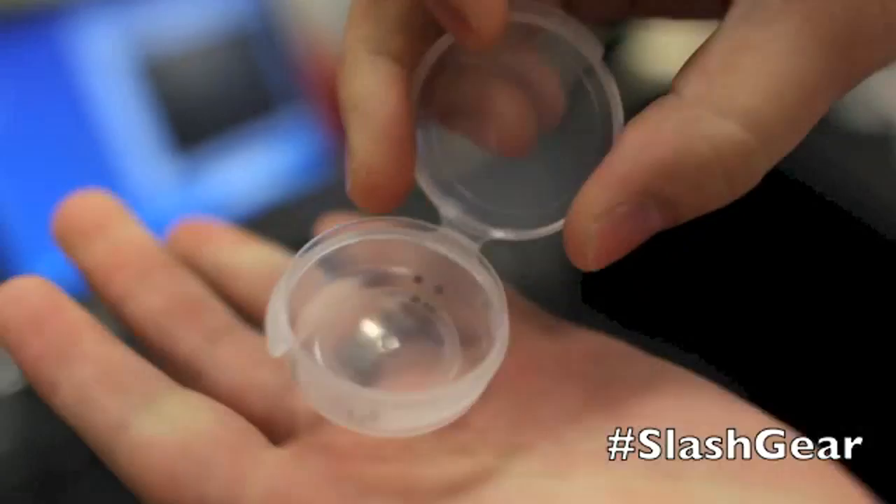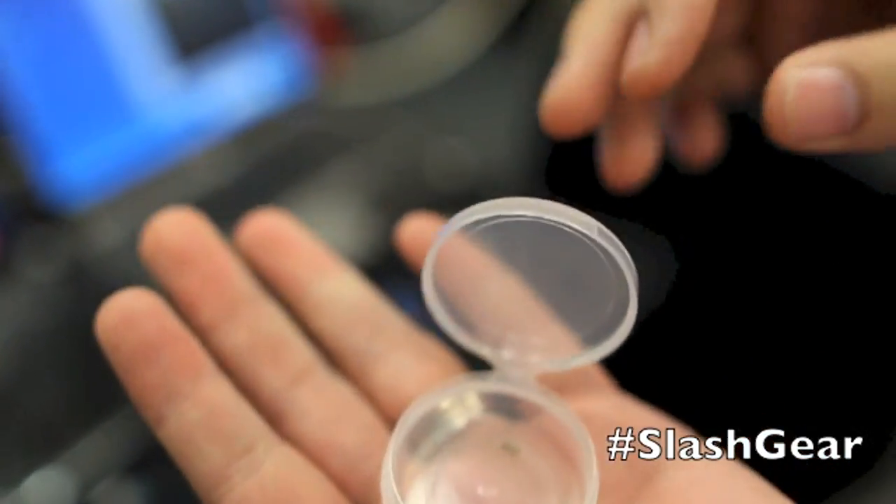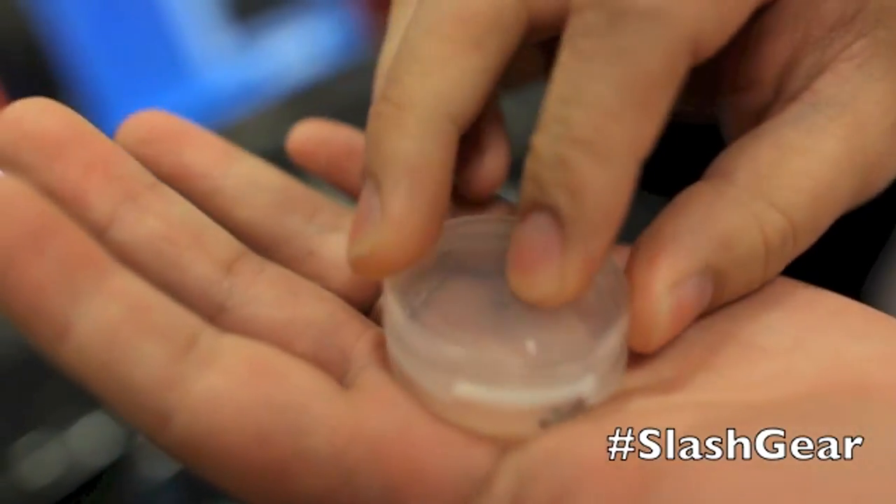We have it right here. As you can see, this is an extremely small device — it's a 1.6 by 1.6 millimeter fully integrated thermopile sensor. Not only does it have a thermopile, it has integrated signal conditioning, an ADC converter, as well as a local temperature reference with an I2C output.